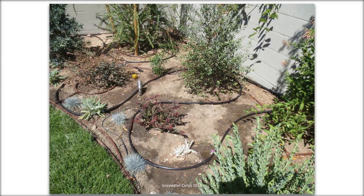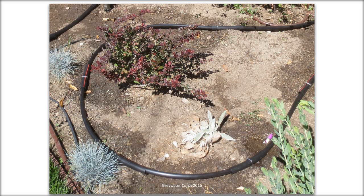Another thing we sometimes do, and this is not as easy to pull off, but if you do have a raised bed or a landscape where you've got a lot of little plantings, it's hard to irrigate all those little things. With fruit trees or shade trees, the root systems of the trees will find the water. This is something we do. It's half-inch tubing, and we'll drill holes in it and then put a sheath over each hole so you don't have gray water spraying out. It's kind of like a homemade drip line.